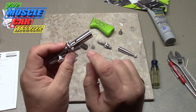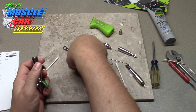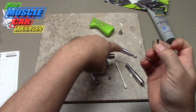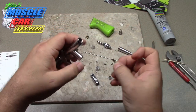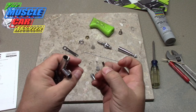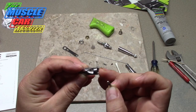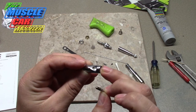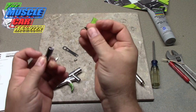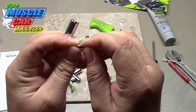Inside here there's a plunger — you can kind of see it through the hole. This is the part it slides on: when you slide that back it pushes this down, which pushes the air valve to let air flow. Now that it's worn, it's staying up and then finally pushes all the way down to let the air through. The manual warns you that these two parts need to be lubed regularly every time you tear it apart — you shouldn't have this problem. I haven't been lubing it well. Some of these O-rings have little wear spots and chunks out of them.